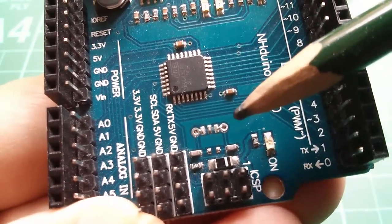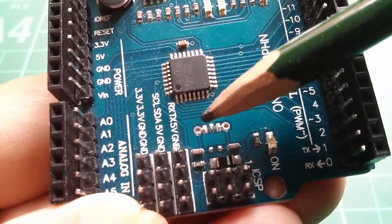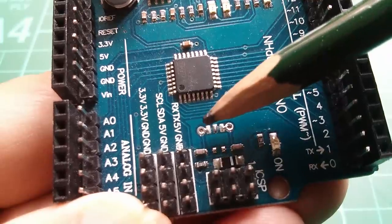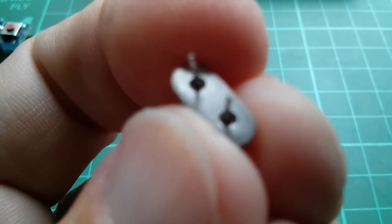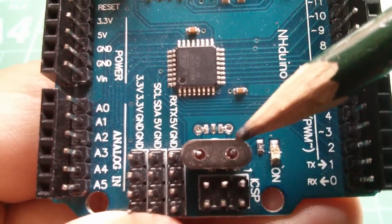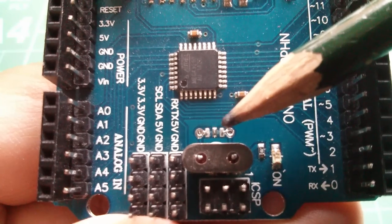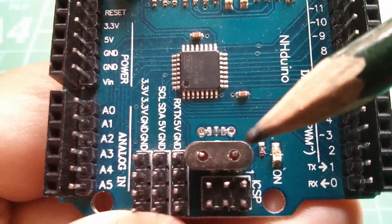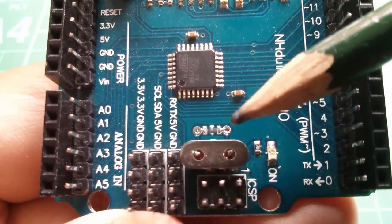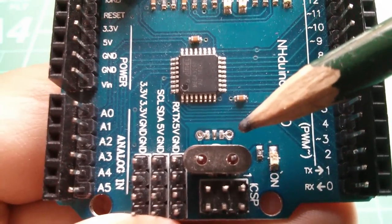And this is what I found under the crystal - there are the through-hole pads, but there are also these surface mount pads, which I think are probably there so that a surface mount ceramic resonator could be put on here instead of the crystal. But those pads are quite closely spaced in the middle, and the underside of the crystal is all metal. So the underside of the metal can could conceivably bridge across the two surface mount pads, thus shorting the crystal out - and actually, that's what was happening. The designer was thinking the crystal needs a little insulating washer, but it hasn't been fitted. So maybe they were making a batch, the washers ran out and they decided, oh let's just shove the crystals in without the washers - what could possibly go wrong?